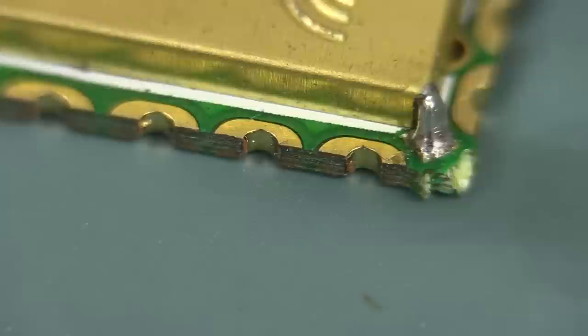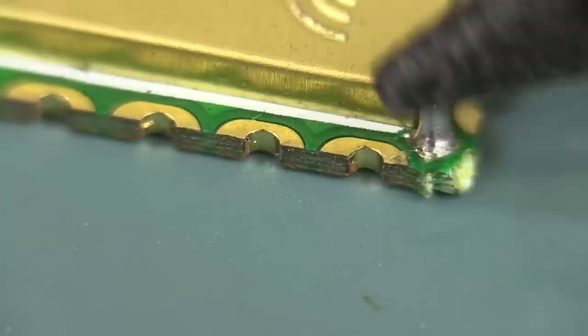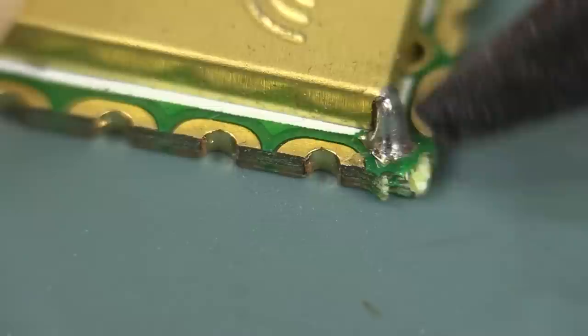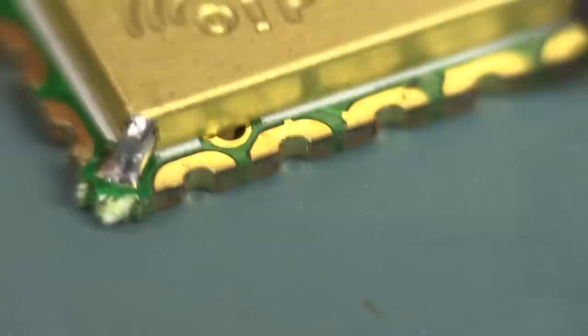You can see that you just do them like a regular through-hole pad, and then define your cut, your routing path on your board, to go straight through the center of the hole. And then you end up with, my pointer looks really huge on here, this half-moon shape with the plating going through the half-moon hole there. It really is an easy and simple technique. Those ones on the side there are a bit messy. These ones here, a little bit cleaner, but quite a common technique.